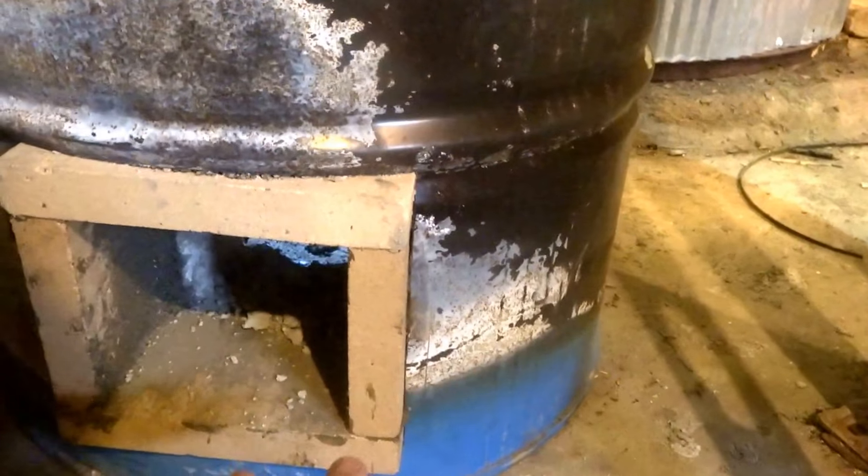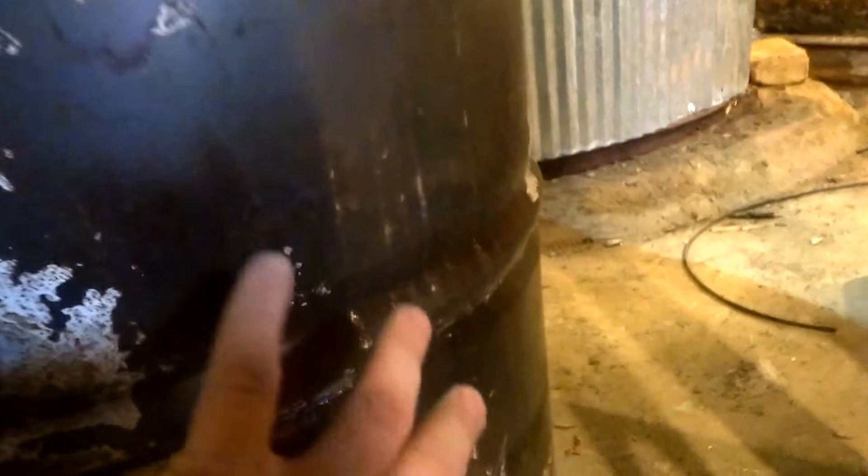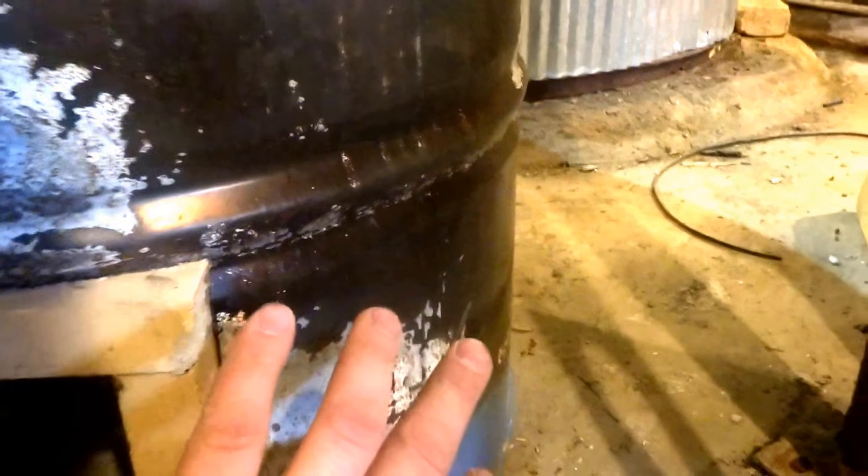The progress I've made so far: I cut out the spot for the wood feed, poured a layer of dense castable refractory in the bottom, and once it cured up, slid the bottom fire brick in place. I poured it specifically so the bottom brick would line up exactly with the bottom of the mouth of the rocket stove I made last year. Then I cut my two fire bricks to height on the sides, ran the top fire brick, mixed up some refractory, went around the outside of both walls, filled in on the inside, and broke up some fire brick and dumped it in the bottom for fill.